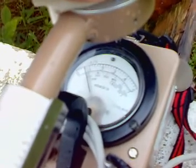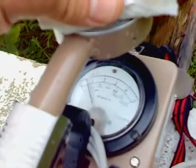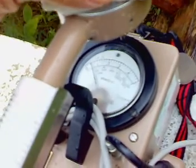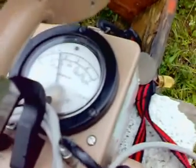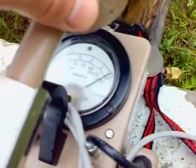That's something I've noticed — you tend to get a low reading at first, and then a few minutes later it starts picking up. It looks like you have different isotopes here just disintegrating, and they have different disintegration times. So it's not a really linear decay. You can average it out — I'm happy saying it's 600. I'm not going to squabble over a few hundred counts per minute at this point.